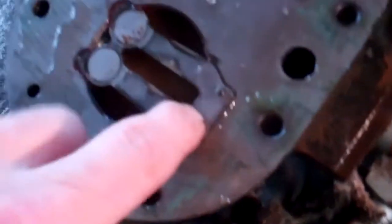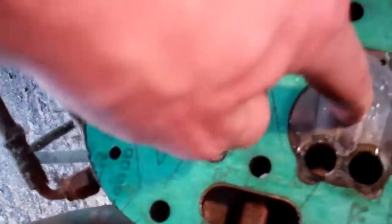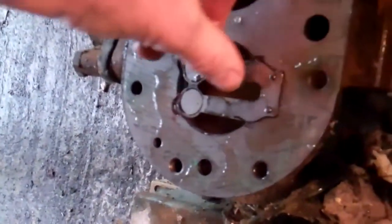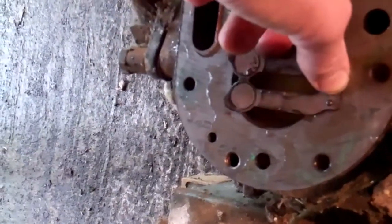Little locating pins and a little piece of rubber under there. That's your suction valves, and then your discharge ones are here. As the gas goes through it, it pushes them open. These ones, as the pistons go down, they get sucked open. As they come back up, the gas pressure causes them to get sucked open that way, and as the gas pressure comes up they're spring-loaded too, so they snap shut.